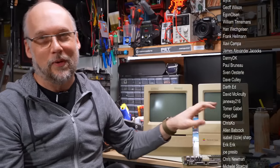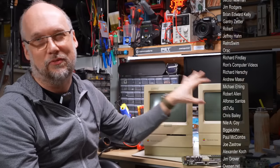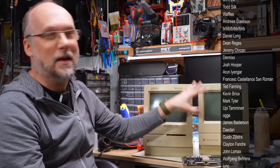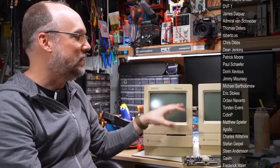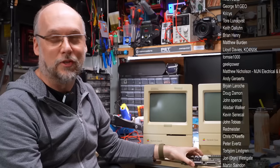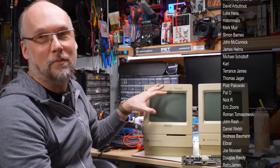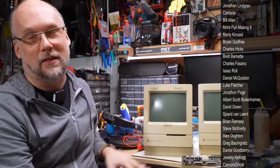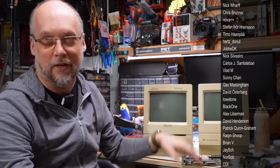So if you're in the market for one of these machines, you best just avoid these things. Really, just avoid them. Get a Macintosh SE or a Mac Plus or something like that. The SE30, unfortunately, has really bad capacitor plague on the motherboard as well, so it's gonna need help. At least the rest of the Macintosh SE30s are reliable. It's just you got a double whammy with these things, which is why I'm like, yeah, just steer clear.